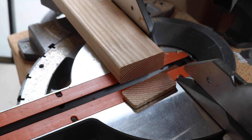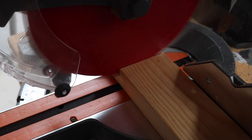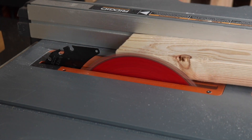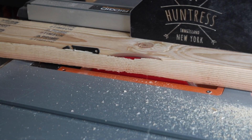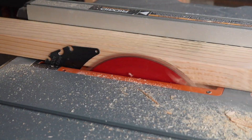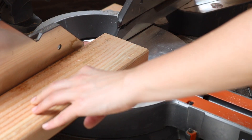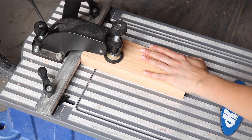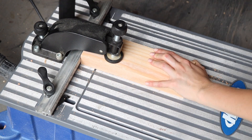I know I just mentioned a lot of parts, but you can check out the full list with dimensions on my website to make it much easier. I made sure to trim all pieces a little longer than needed at the miter saw, because I then brought them to the table saw to cut off the round edges and clean them down to size. This meant the legs were a little thinner than my initial measurements, so I had to bring most pieces back to the miter saw to cut everything to its final length. After trimming to final size, I brought nearly every piece except the leg pieces and short shelf pieces to my pocket hole jig and drilled pocket holes in each end and along one side of every piece, so I could connect them to the legs and to the top and bottom shelf.